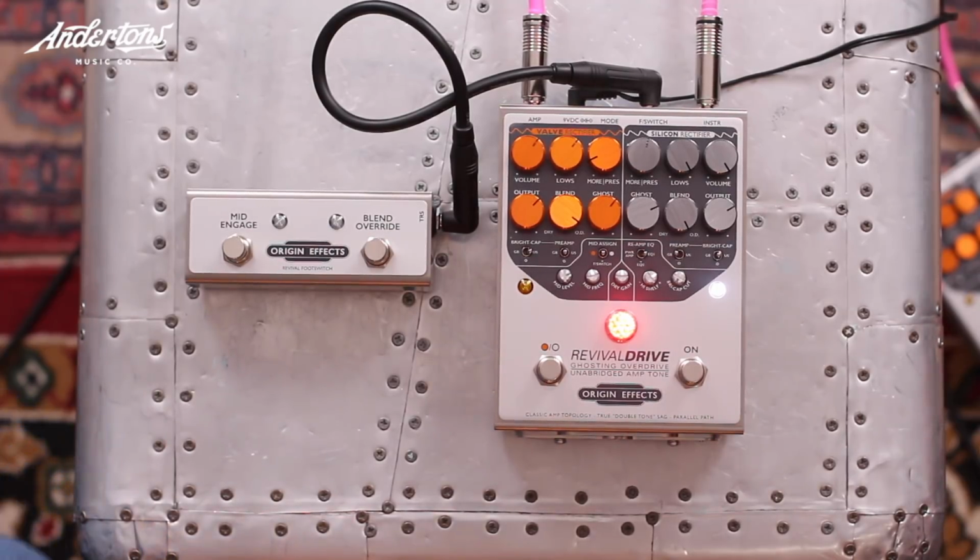So talk us through this idea of the ghost note then. Is that another word for cone cry, or is that a different thing? Well, cone cry is a different thing, though they can sound quite similar. Basically with cone cry, the cone is resonating in quite an uncontrolled way. Early 50s cones didn't have any kind of treatment to the edge of the cone, so the cone could flap around. Certain notes make it resonate in a certain way, and it creates extra tones. This is slightly different: the mains frequency from the socket is coming into the amplifier and being rectified, and there is a ripple related to the mains frequency. When you distort the amp, that ripple finds its way into the signal path. So it's a similar kind of thing, but a different mechanism recreating it.